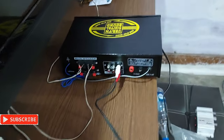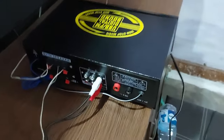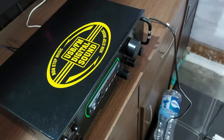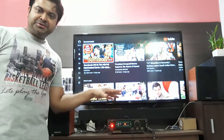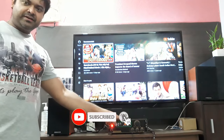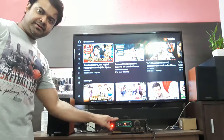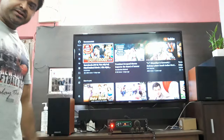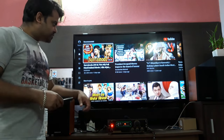And we're done! It's a very simple thing — you just need an RCA to 3.5mm cable like this. Connect the 3.5mm side to the TV and the RCA side to the amplifier. Now let's turn this on and check the sound. YouTube is on and I'm going to play some songs. I've positioned the microphone right there so it can capture the sound equally from both speakers.